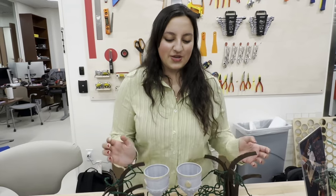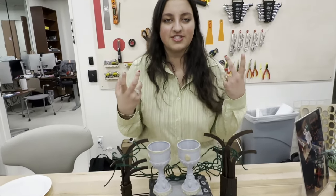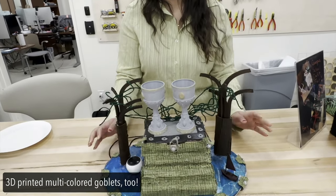Here I have the Arduino Nano, and I use the proximity sensor, the APDS9960. I have two of them under each cup, so it senses when the cup is lifted. And once it's lifted, it plays the sound and lights up. The poison is red lights, and the serum is gold light.